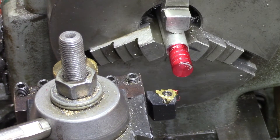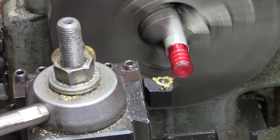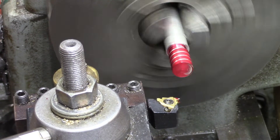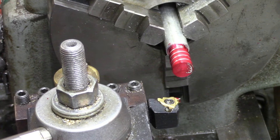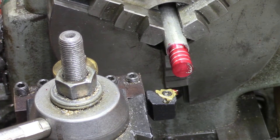I'm going to cheat here — I'm going to put it in the groove and close the half nuts before I turn on the motor. I made myself a really nice wide thread relief, nice and deep and wide, because I knew this was going to happen really quick. So here we go again — let's go in just about five thousandths.